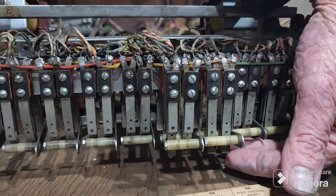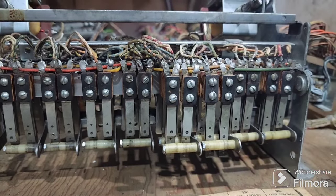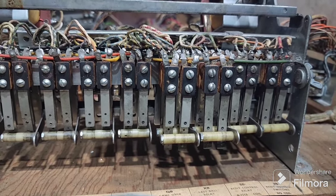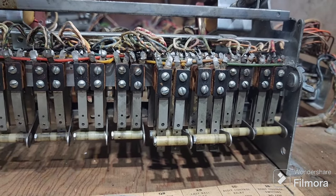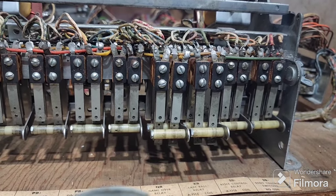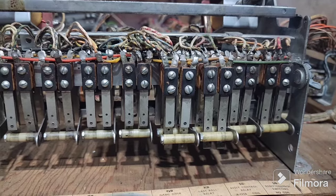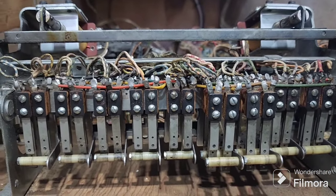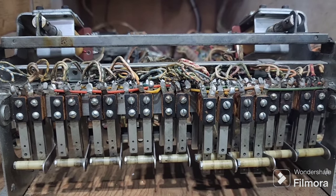On the reset relay? Yeah, that one there. Okay, so it's a make-break, and what was happening, it was making all the time and causing it to engage those. So basically every time something happened it would start the reset because it was in reset mode. The guy that dropped it off said every time we hit a drop target they reset. And we said, that sounds a bit suspect. So we pretty well went straight to check the reset, and that was it.